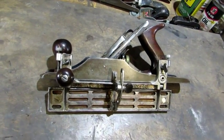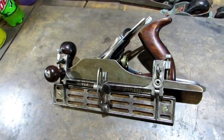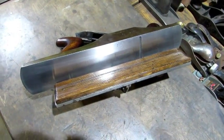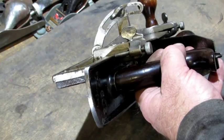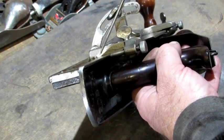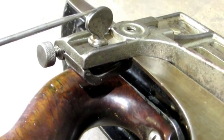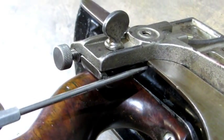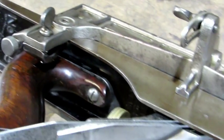I've selected a Stanley Bedrock 605 for the test drive — got her all hooked up, tightened up, ready to go. Stanley definitely knew what they were doing when they designed this jointer gauge. It wraps around the base of the plane right here, and this screw tightens up against the top edge of the side and locks it in place. In addition to that, you've got this plate on the back side that this screw locks down right up against the inside of the side of your plane. So between those two, that thing is locked secure and it's not going to go anywhere — you've got them on the front and the back.